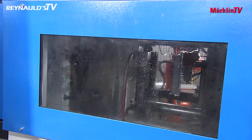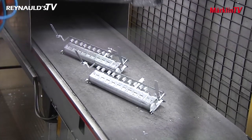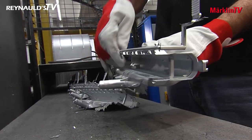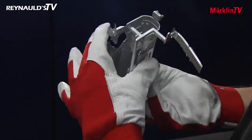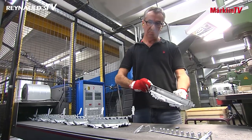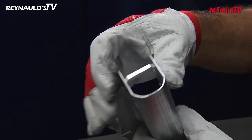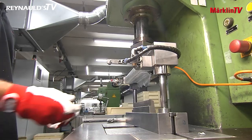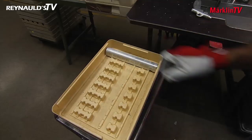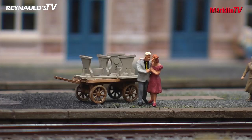Meanwhile, the mould of the compartment coach has reached the zinc die-cast department. The first few pieces have been completed. At this point, it is crucial to ensure that the material and the mould work together perfectly. Some of the more tenured staff carry out a thorough quality check on every piece during pre-series production — even the smallest flaws need to be amended as soon as they are spotted. It's common practice with club models to build the pre-series models with some production parts, allowing staff to ensure that all parts fit together as they should and make corrections where needed.